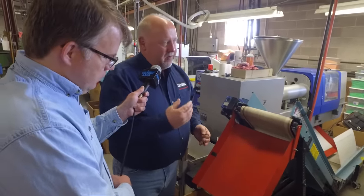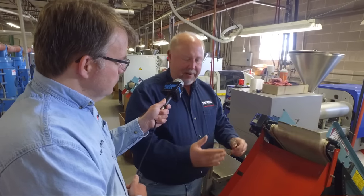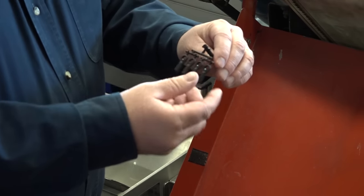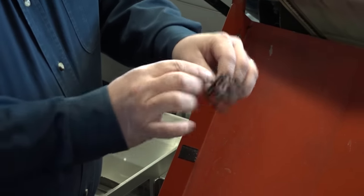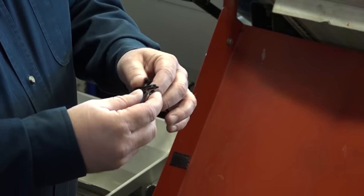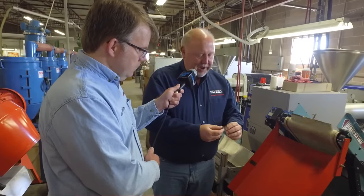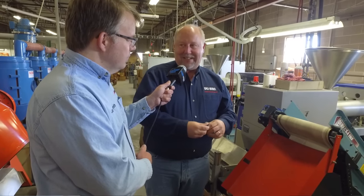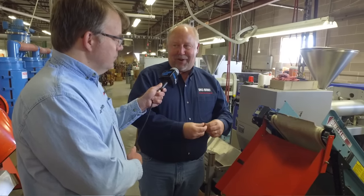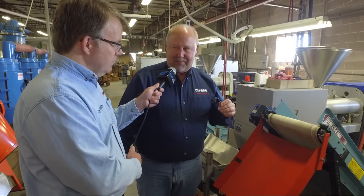What's important: when you buy a part made out of plastic, we use all-virgin material. What that means is first-time, brand-new material. One of the dangers — this is called a runner — when you regrind this, you're losing some of that strength. A lot of times we get calls where guys will say, 'I broke this part on this airplane I bought,' and it was a product made offshore. A lot of times the plastic used in offshore models, I would be guessing, is not virgin material — it's regrind, and the parts are more brittle. We make sure and go the extra effort to make sure we deliver a quality product.